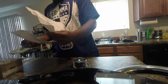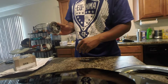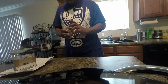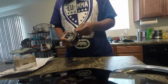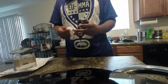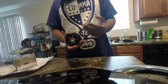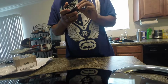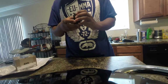Okay, my invoice. Got my invoice, and for those that don't know about the ZP, it's supposed to be Grip-Tec. So Grip-Tec pulley. It's a different process they're using that they're saying pretty much is way better. They grind down the journals and then they re-weld back on it, and actually it looks pretty good.